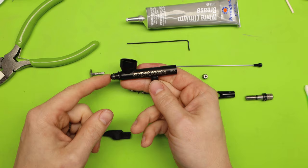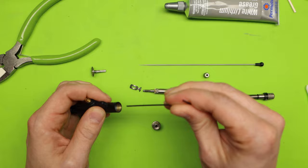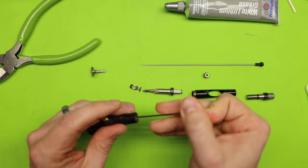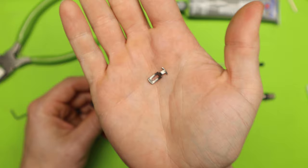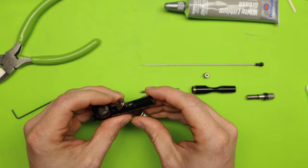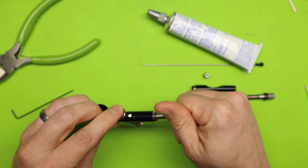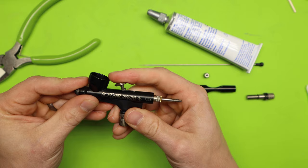So next I'm going to go ahead and put this ergonomic grip guard back on — it just slides on, then you take the Allen key and tighten it back on. Then the nozzle adapter. Now I'm going to take the trigger and install it. Then I'm going to take the auxiliary lever — an important thing to note: the curved portion, the big curved area, actually goes towards the back. And now the spring guide — I'm going to go ahead and put a tiny bit of grease on the threads and install that. Just check my lever — spring is looking good.